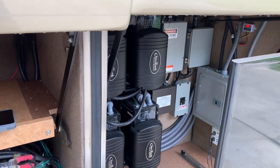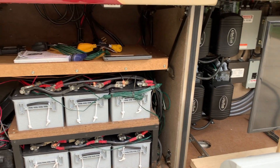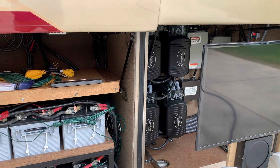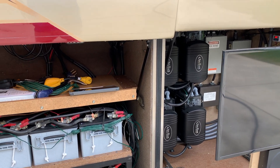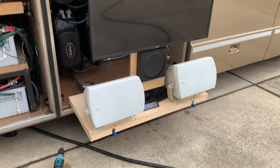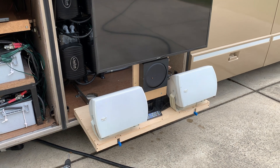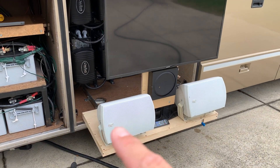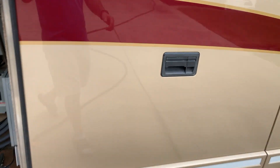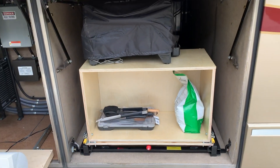I can run one air conditioner off 3000 watts of battery. The inverters have 50 amps of pass-through, so when I plug in somewhere I don't have to worry about both inverters working and trying to talk to each other and share when I go beyond 30 amps — that's always kind of worried me. I'll have another video when I get the different parts. Right now I'm trying to figure out exactly what I need, looking at all the cable sizing to make sure it's correct.